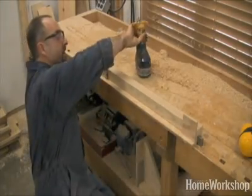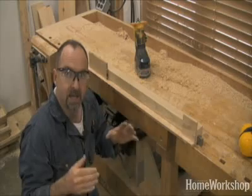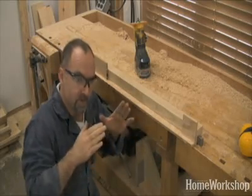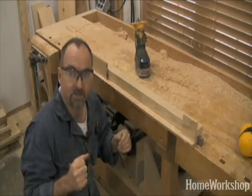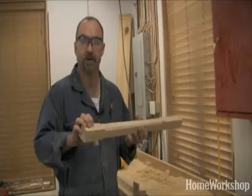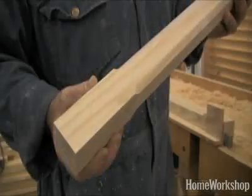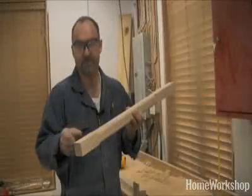You can use this technique of using a jig with stop blocks for all kinds of applications involving chamfers that have to be a certain length and identical to other chamfers on project parts. Repeat the process for all four corners of whatever you're routing, and you'll end up with some beautiful, even, attractive chamfers, just like you see here.